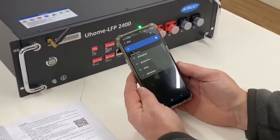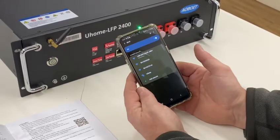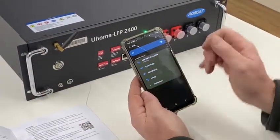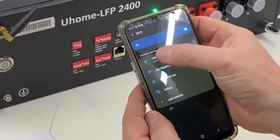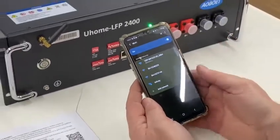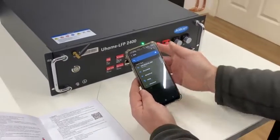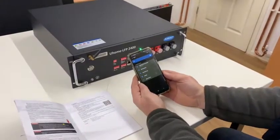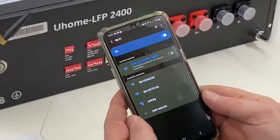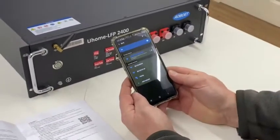Once you've had a refresh or two, the USR number — which is the modem number of this unit — will pop up on your screen. Select that, so you're now pairing your phone to this particular modem in this particular unit, which is why we do it one at a time. Connect to it, and if it says it wants to disconnect, ignore that — this is what we're connecting to.